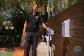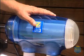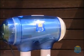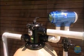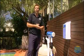Next we're looking at the salt chlorinator. From time to time you can get calcium deposits built on the salt chlorinator that need to be cleaned out. In terms of filtration running time, in the peak of summer you really need to be running the pool a minimum of eight hours a day — it's a good idea to break the times up, maybe four hours in the morning and four hours in the evening, and it's best to run it when there's no direct sunlight on the pool. If you have a solar booster system, you may need to run it ten or twelve hours a day. Check with your local pool professional to see what best suits your pool and how much chlorine you need.